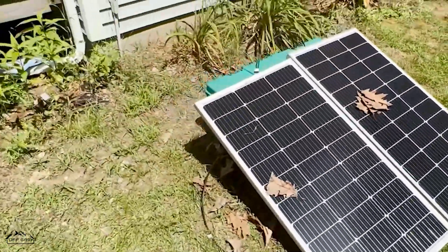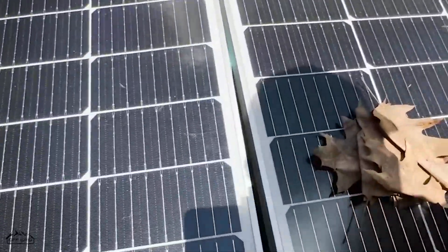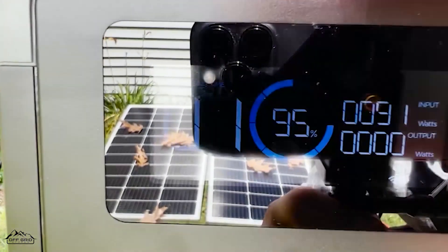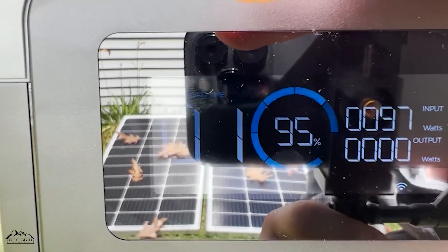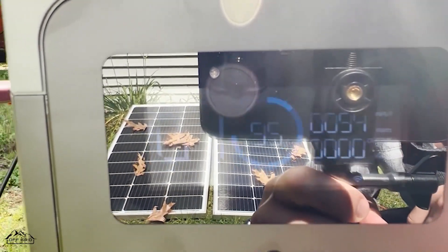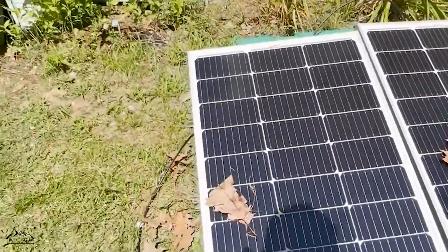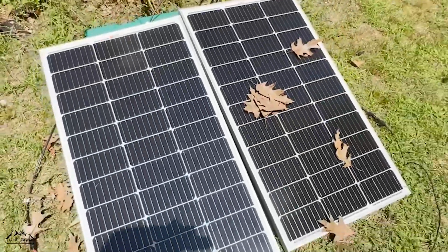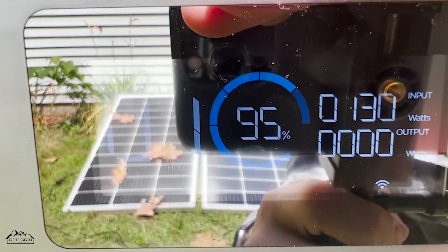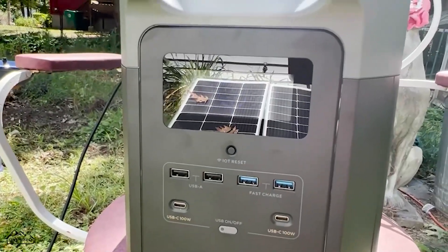I'll try to throw a few more leaves on just to try to cover a couple more cells. You'll see it's still around 90-something watts — obviously if it was all covered it would do a lot worse, but that's to be expected with a series hookup: they're both going to be affected the same way. Now let's do a parallel hookup. I'll take everything off one of them just to show you — it's still around the same, now it's going up. They're both pumping around 60 now. So let's switch it and go to parallel.